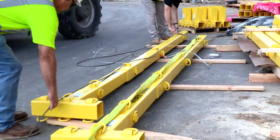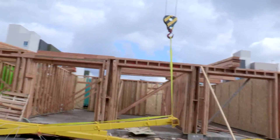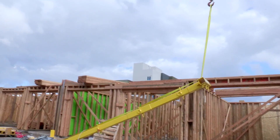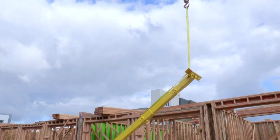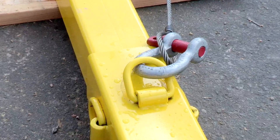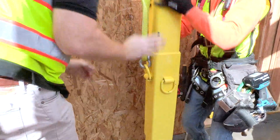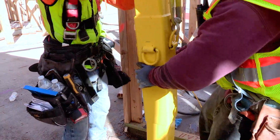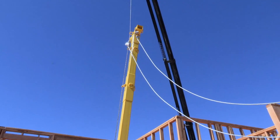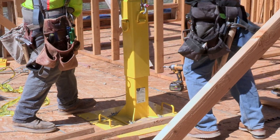Take the 2 inch by 20 foot truss strap. Run the truss strap down the middle D ring of the T section through each corresponding D ring, shackling the 20 foot truss strap onto the lower D ring of the 10 foot section. Attach the side steadying cables to each pole prior to hoisting. We recommend that the pole be guided onto the base using two workers. Beware of pinching fingers. Begin hoisting each pole with either forklift boom attachment or crane. Repeat for each pole being installed.